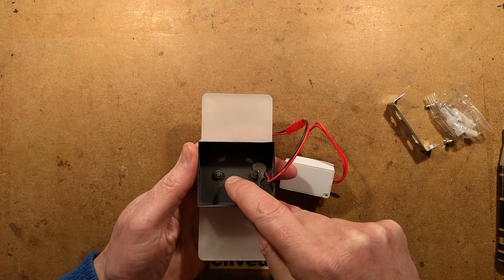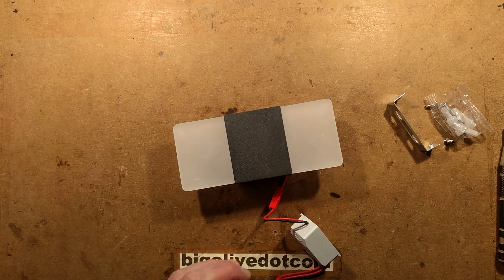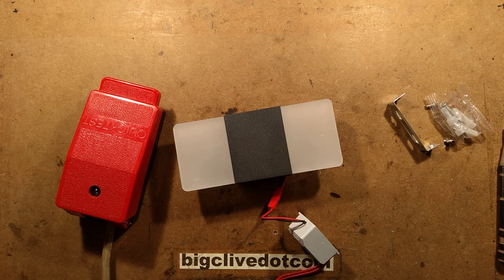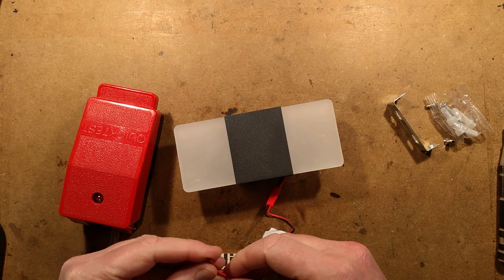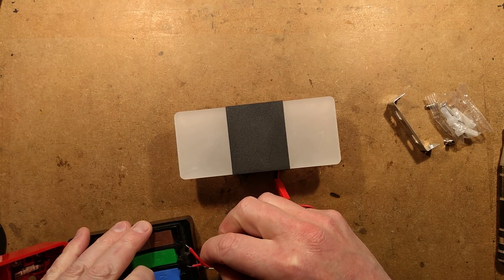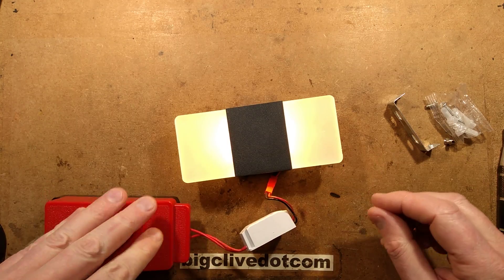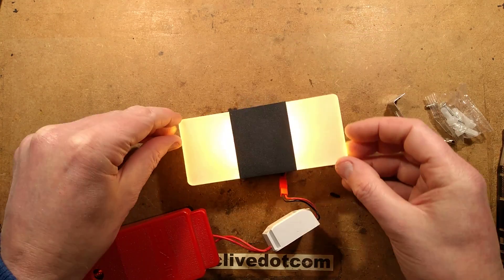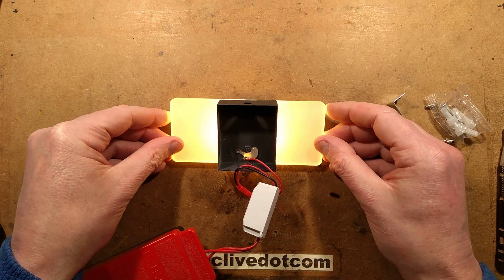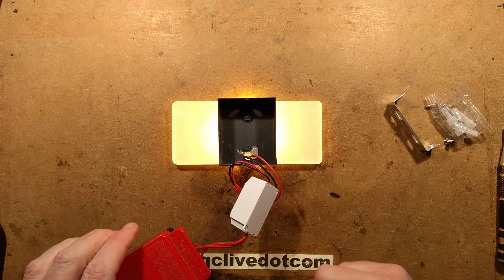The front must come off to reveal some screws. Let's plug this in and get the quick test in. I've already measured the power — it measures 3.4 watts. Power factor is 0.55, which is really pretty typical for these sort of things. The current is 25 milliamps, and it looks okay — you could mount it vertically or horizontally. The main issue is that the metal box is not grounded, and the separation of these little power supplies is debatable. It doesn't leave you a lot of room once the power supply is in.